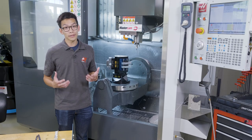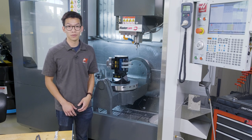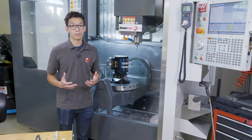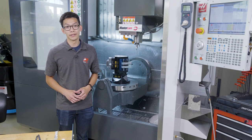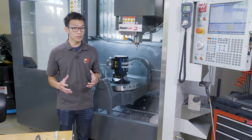In this video, I'd like to talk about programming toolpaths on the multi-station fifth axis tombstone fixture. We'll take advantage of the planes and fixturing Jesse highlighted in a previous video and walk through optimizing the toolpaths to really reduce cycle times on these parts.